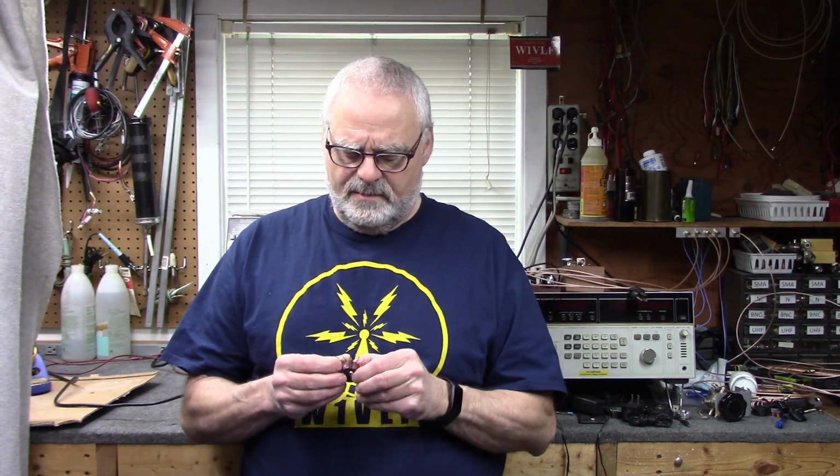So what are the advantages of this antenna? Works super down to, you'll see, about 16 kilohertz. I can even see DCF 77 very strong out of Germany. No preamp is required out at the antenna, nothing active.